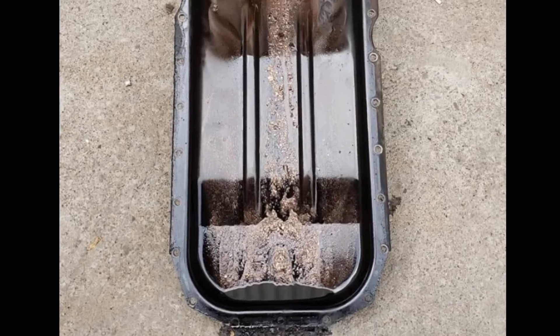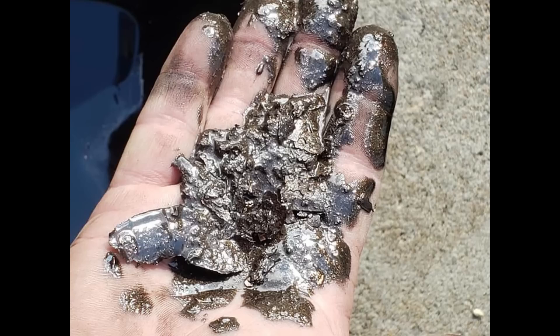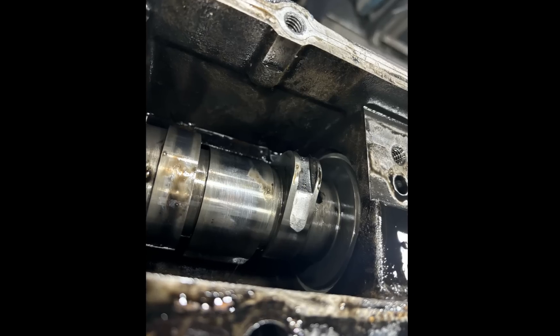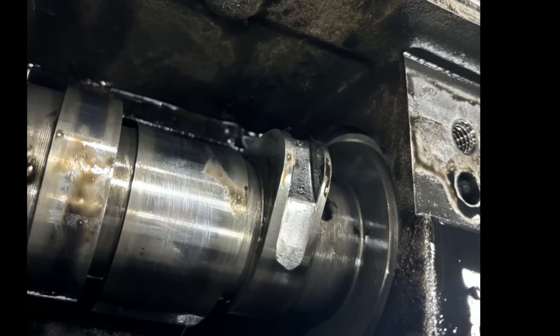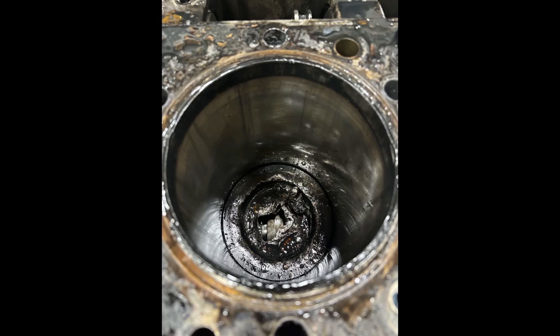How about a little destruction of the week? Our first comes from Dean — this looks like something out of a Discovery Channel gold prospector show, but no folks, this is a Cummins oil pan. This is a number two rod failure; big time problem when that's in your oil pan. Next one is from Jackson — a C13. I have never seen a cam failure quite this deep before with the outer profile. The cam is still there, but they kept running the C13 until it eventually dropped the valve, broke a hole in the piston where you could see the connecting rod through. Thanks for watching.